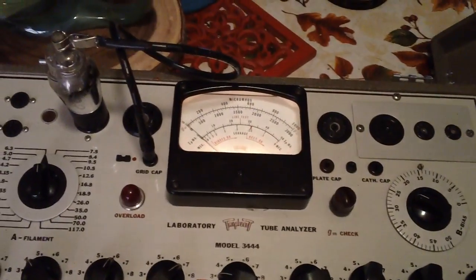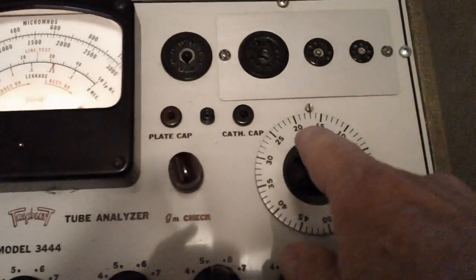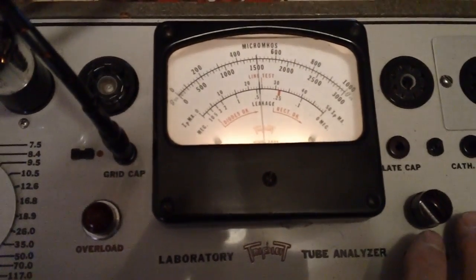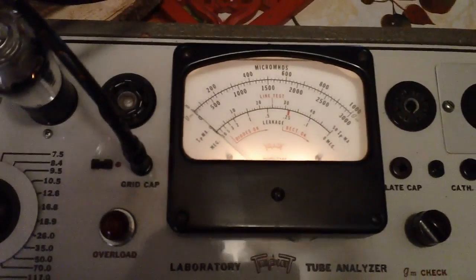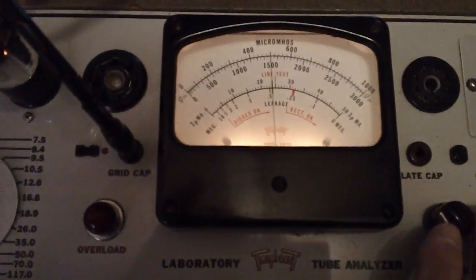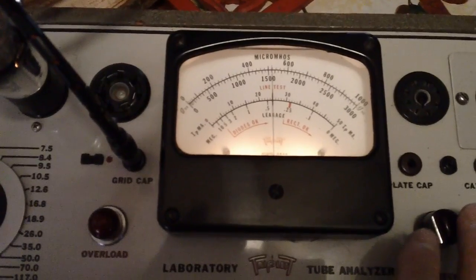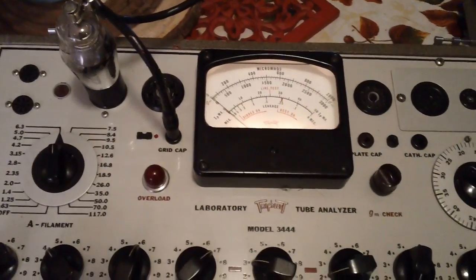Let's set this thing up for a 78. Alright, I've got everything set up for a 78 tube, and it required 17 on the bias for this one. Let's go ahead and pull our lever. Okay, we're doing pretty good on the tube strength, as you can see. We're supposed to be using scale number two, which is this scale right here — the second scale down. But we're not concerned so much about that; it's a strong tube. Let's move the bias again — from 17 up to 18. Almost nothing's happening. Let's go down... we're down to 13. Almost nothing's happening. I would say offhand, based on what Norm Leal said and based on what we just found, this is not a 78 tube, it's a 77. Until next time, this is John.